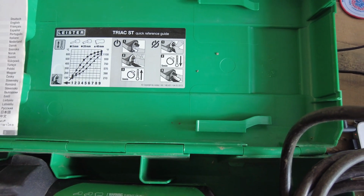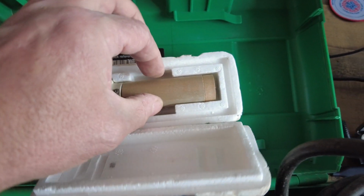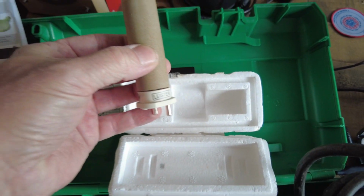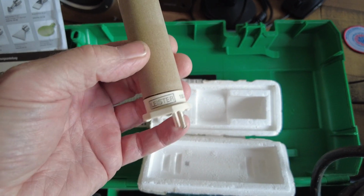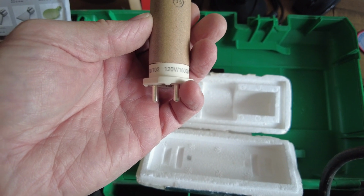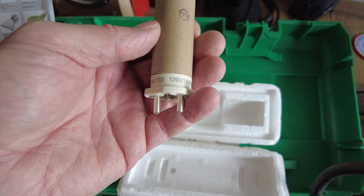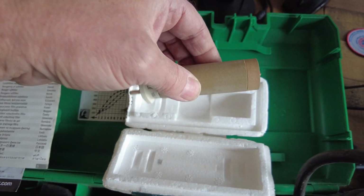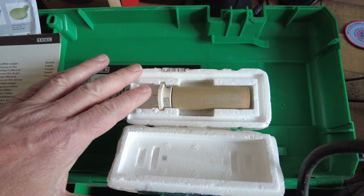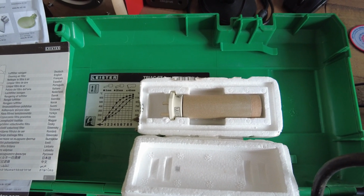The one thing we don't want to end up in the realms of is having to replace these. These are the elements. So if you do start seeing wear and tear in your heat output, the chances are the element's on its way out. Make sure you get the right element. So this one is 120 volt, 1600 watts. This is used on our 110 equipment. They do a 240 version as well, or a 220. Indications that the element's starting to fail: you won't get the heat output that we saw on that first example there.